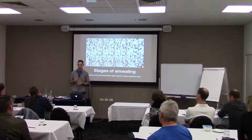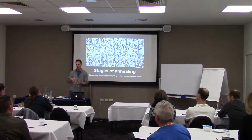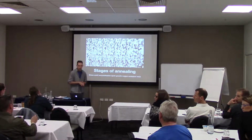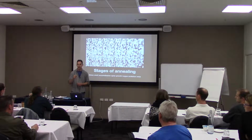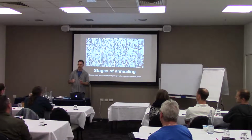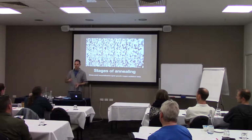Sometimes you'll see spot annealing advertised that way. People are trying to cause grain growth in that area without affecting the other. So you're saying that you get renucleation from cold forming as well? No, that's only after you heat it in the annealing process. The cold forming causes more stress to create more nuclei. Ah, I get it. So you're actually increasing the number because of the cold forming. So now your grain count might be 120 at that throat, and it might be 10 out at the flare. So you're like, how am I going to even this out?